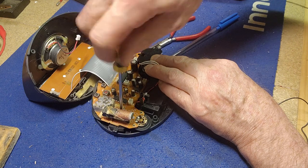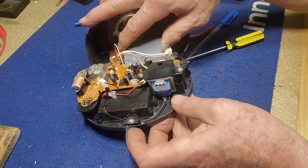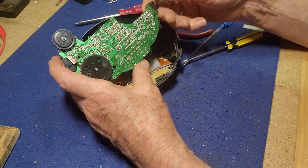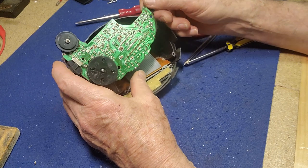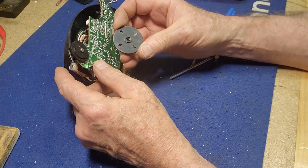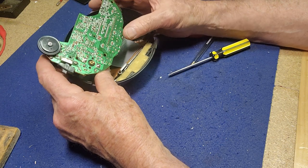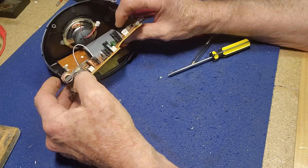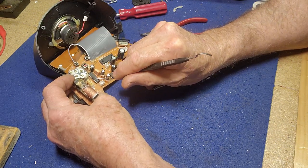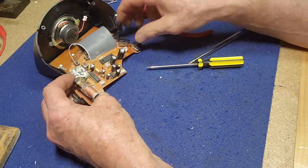There's another screw under here - that's all just two screws. This ribbon cable is going to be a bit of a problem. There's our circuit board for the unit. That's our tuning - let's take that off so we can see more of the board. It just fits on a double-D shaft. I can't see anything obviously wrong. There's been no corrosion, no scorch marks. I'm thinking we may have a bad capacitor or something. The top of that chip must have wax on it - looks like it was cracked, but it's actually just got a coating of wax, maybe hot glue. I think that's going to be all right.